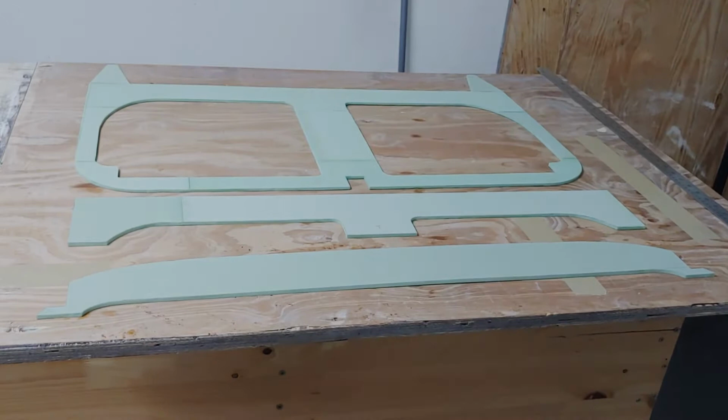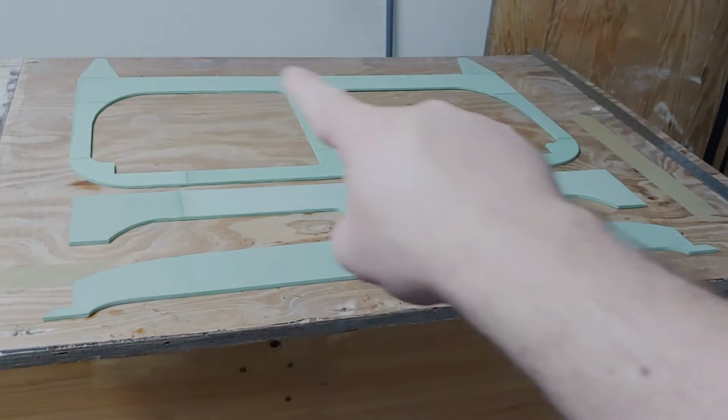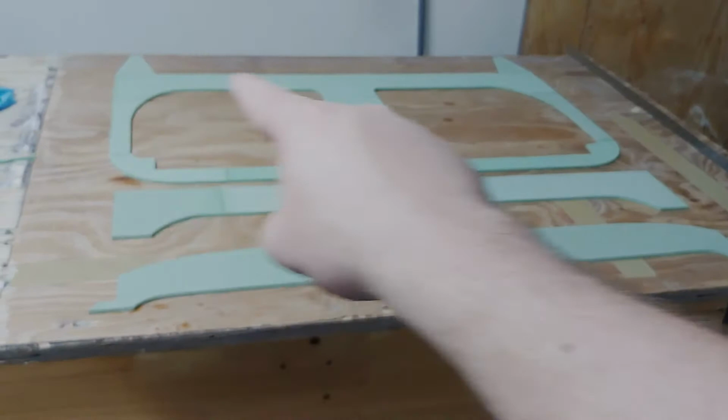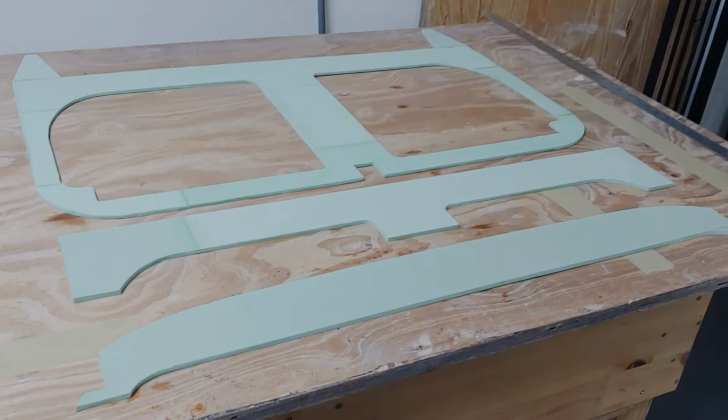So this is all getting glass on both sides. This doubler goes on that piece to double up with glass, so it makes like triple layers. Glass on the back side, glass between the two, doubler goes on top, and then glass over all of that, because that is a really stressful part of the structure. The canard, the front wing, is attached to that bulkhead there, so it really gets beefed up a lot. So that's me for now.